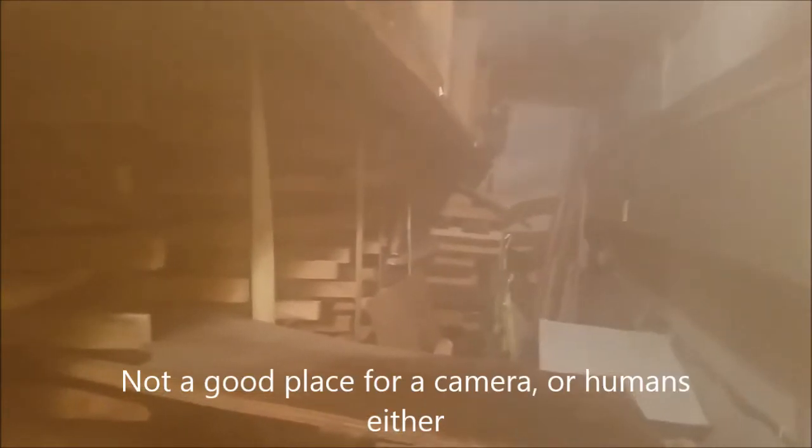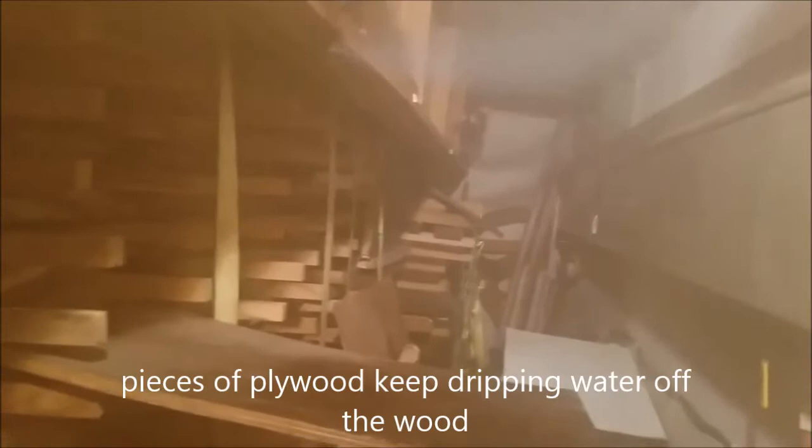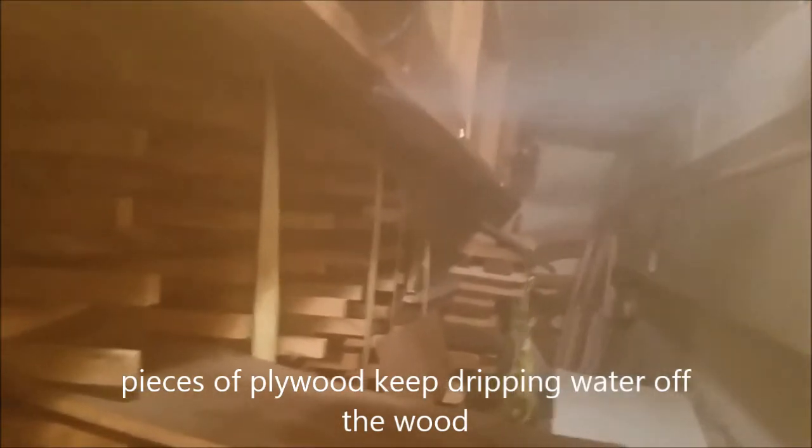This is the only way to properly condition wood, which basically plasticizes the outer fibers or the shell of the boards. It takes approximately 30 minutes, so I'm going to flash about 15 gallons of water into steam, and the humidity will get up to about 95% by the time I'm done. Then I open the doors and rapidly drop the humidity. The last part of the kiln drying process is equalization, where I just let it sit and equalize, because I want the moisture content to be as even as possible — not being in a hurry is advantageous.